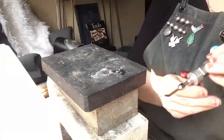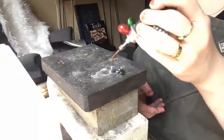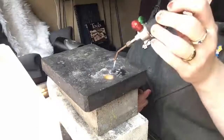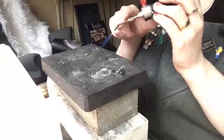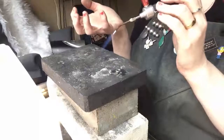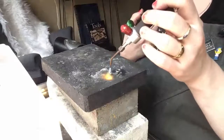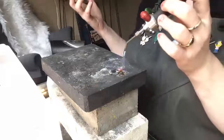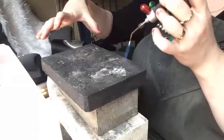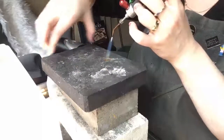Maybe a little too much flux — it does have a tendency to soak up the flux, but that's okay as long as there's some on the metal. I use the little torch, and that's part of the reason I got started on charcoal blocks — the little torch has such a small flame, but the charcoal block is so reflective that it's okay to use a small flame on something a little bigger than you normally would, because there's so much heat coming up from the bottom. If I just heat on the charcoal it gets a little red — kind of like when you go camping and use charcoal for a grill, it retains heat really well. If you're soldering a bunch of stuff on this block and start over here, it's going to build heat so that by the time you get all the way over to here, those pieces will solder much faster.